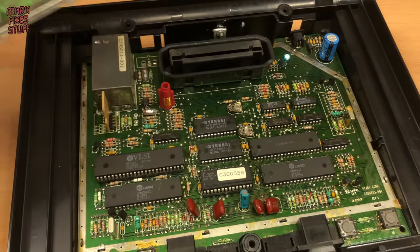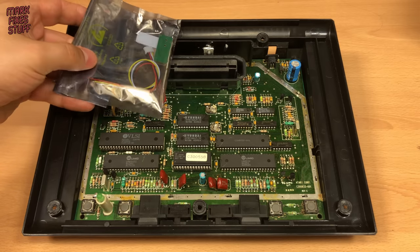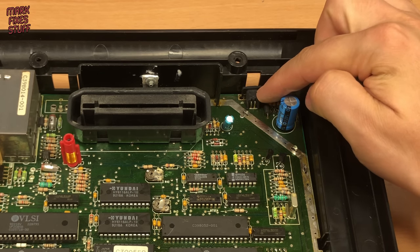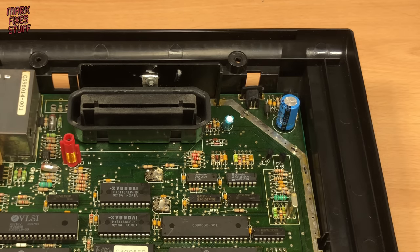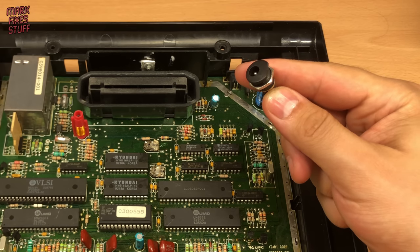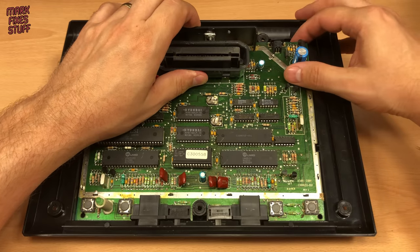Removing the shield we can see a really clean board. We'll be removing the modulator and a bunch of components from here, and then we'll put in the deluxe composite mod kit. We'll change the power input as the original Atari one is a custom connector and hard to find now, even though 3D printing has made that easier. We'll use this barrel connector that I've filed down a bit — I don't want to cut the case at all. Naturally we'll also replace these old electrolytic capacitors to ensure the console runs for many years to come.